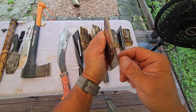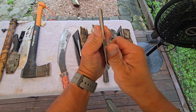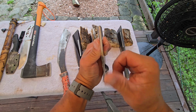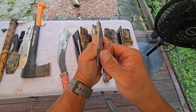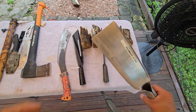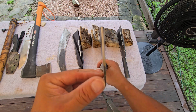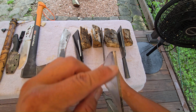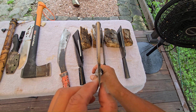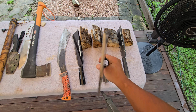And the AX-VEL was tapered like this too, just kind of tapered, and then just straight, and then just a taper. But I gave it kind of a convex grind to make it durable, make it better for wood chopping. So I wanted this. I needed it to be thick the whole way through, and then just shaped to the blade, sharp at the blade area for durability and for batoning. So you need that blade width for batoning.